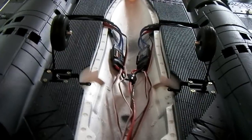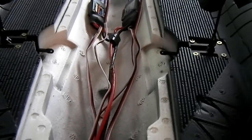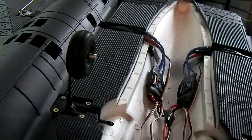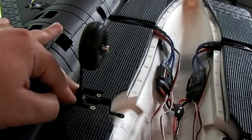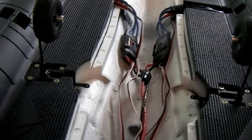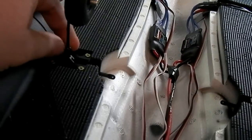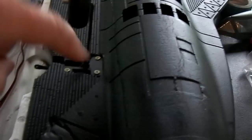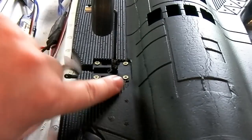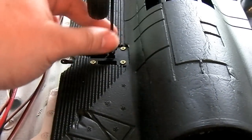This is going to be the last part of part two. I got a little bit farther along — put the wheels on and the rear struts are in place. I do have the servo all installed. I just wanted to mention that the instructions on this really aren't good at all, unfortunately — though fortunately it's not that hard to figure out. One tip: before you put the landing gear in place and before you put these screws in, put these shafts in first. Use the Allen head screw on this side, and then it's easier to screw these into position first, then put a little bit of epoxy around it before dropping them down.